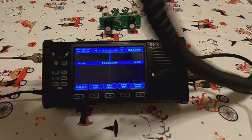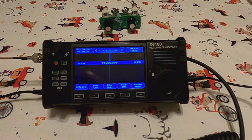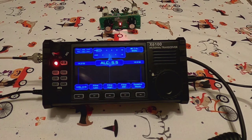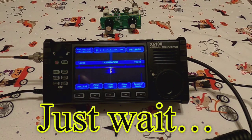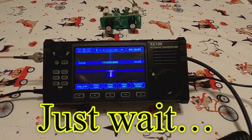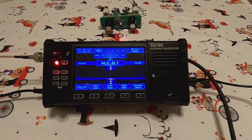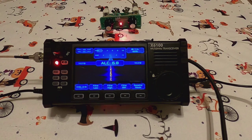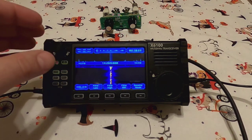But one of the issues that I had in this is when we keyed up and tested, it fed back. There was a lot of feedback. Whiskey One, Radio Charlie, Papa, testing. Oh, it doesn't feed back even with a monitor now. So that's new. This is Whiskey. Oh, there it is. Yep, so having the monitor on is probably not necessary. So we need to find where the monitor is and turn that down. That's if you're wearing headphones. It is nice to have that full duplex in your ears. But for having it out like this, probably not such a hot idea.